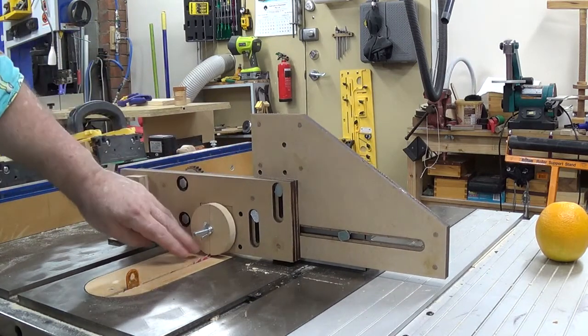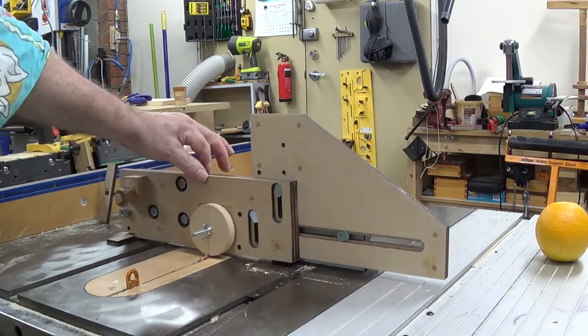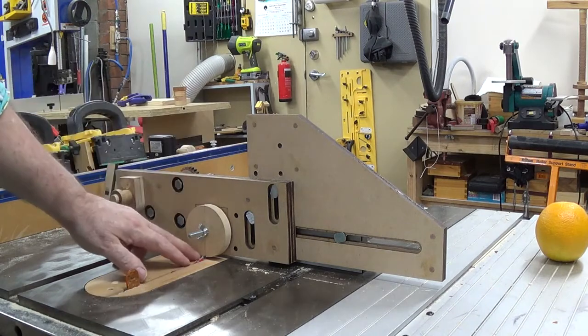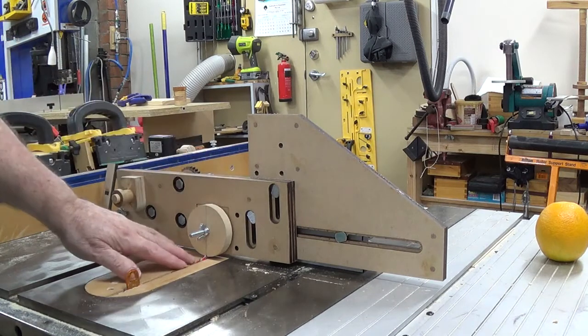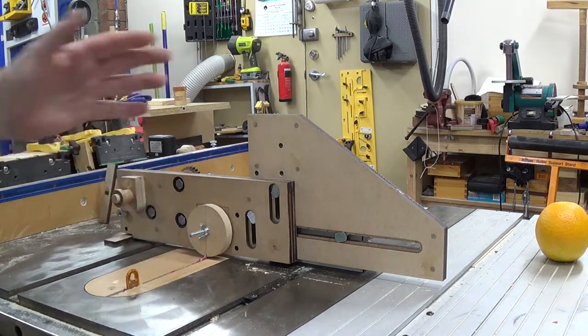What I've done is I've made a test cut to make sure I haven't gone down too low. This is the smallest wheel this jig will take, and if I went any higher up, I start cutting into the gears. So I've slowly snuck up on it — that's why I've already pre-done that. I didn't want to waste your time.